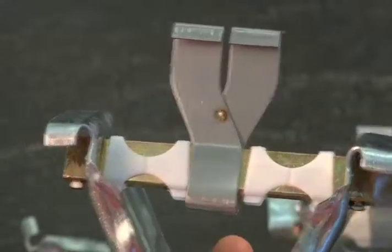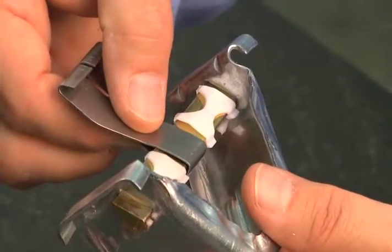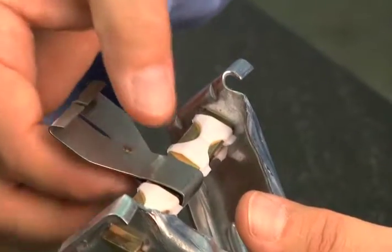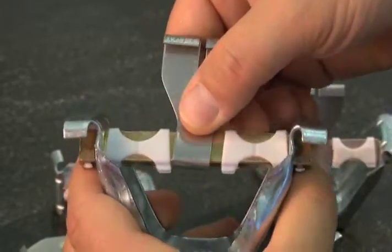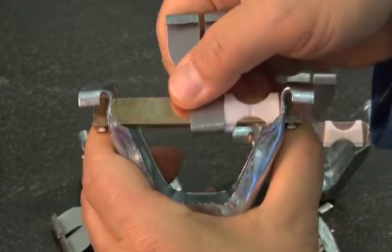The high-strength steel triangular bar is plated, which allows the stainless steel tab to move freely with the forces of thermal roof movement. The plastic centering sleeves keep the stainless steel tabs centered on the clip until installation is complete, and will break away with just a few pounds of pressure when the roof starts to move.